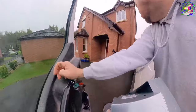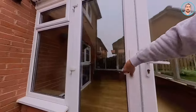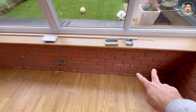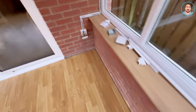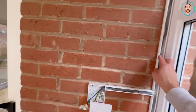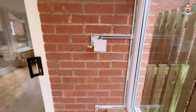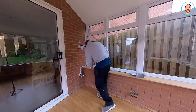Let's go and show you what this job is like. I've got to put a conduit there and chuck two boxes there because he's having a radiator — that's going to get blanked. I need to get some boxes and bring them out. I've just taken the conduit out. I'm going to run this back here, run a cable down, put a new box in, run a cable down there, a box in there, and then I can just dry line everything.